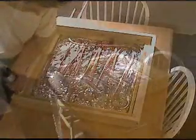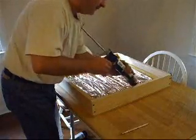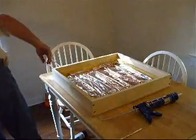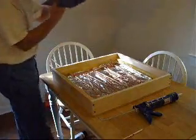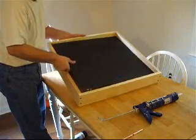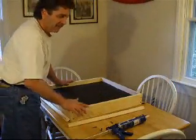You seal in the hot box with a bead of silicone to seal it in place — use an airtight seal. Place your aluminum flat-black-painted sheet over the coil and drop it into place and it will glue in place. The solar panel is now ready for the plexiglass.